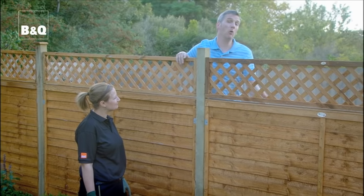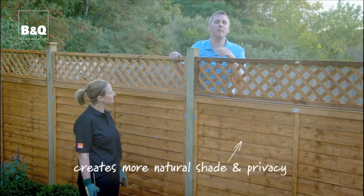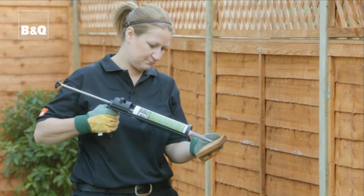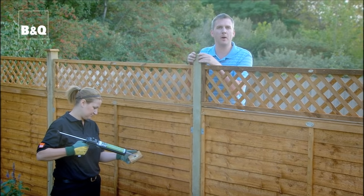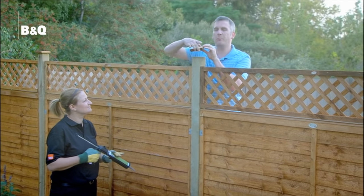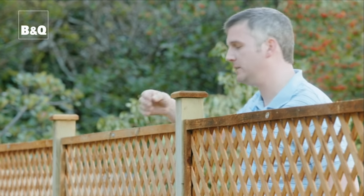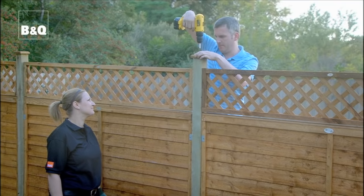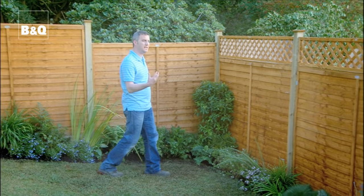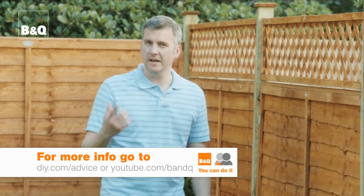We left our fence posts a lot longer than our fence panels — now you can see why — because we've got these strips of trellis along the top, which are perfect for climbing plants. The final finishing touch is to put a post cap on. These aren't 100% essential because these are treated posts after all, but a post cap will prolong the life of the wood. Loretta has put a nice blob of brown sealant on the underside, then we put that on top to get a really good watertight seal and simply screw it down. We've used a standard treated fence panel here which we're going to allow to weather to a lovely light grey colour, but you could use wood preservative or even some fence paint for a contemporary look.